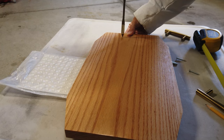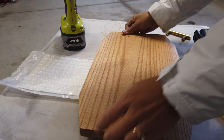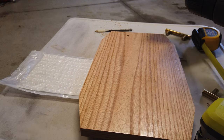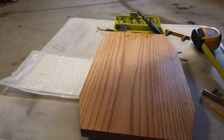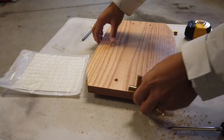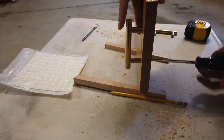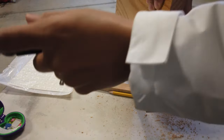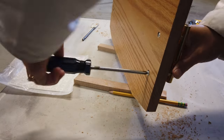So what I'm doing right now is adding a hole for the screw to sit into — I believe it's called countersinking — but I don't have a specific drill bit for that. So I used one of these drill bits and applied tape around it so that I know where to stop without going through the actual board. Then I took a pilot hole drill bit and went straight through the board because that is what the screw is going to go through. Now that the holes are done, I can go ahead and attach the handle using the screws that it came with. I took the screw and slid it through the underside so that the head of the screw would sit into the countersunk hole that I created for it.